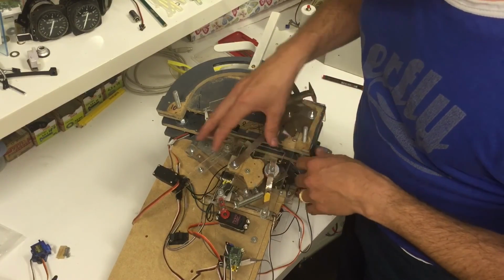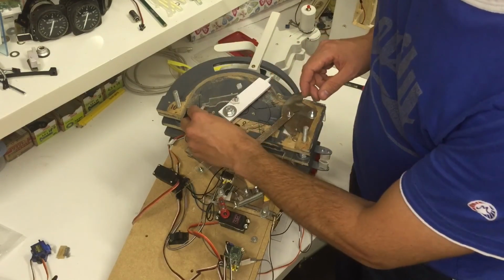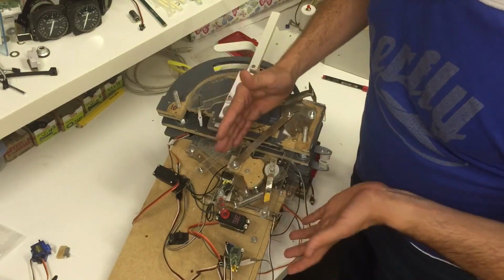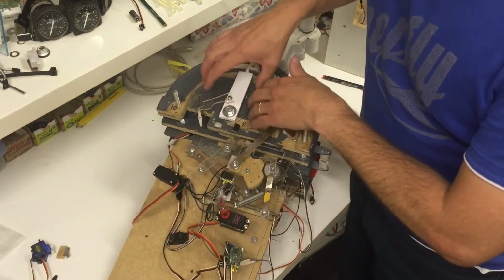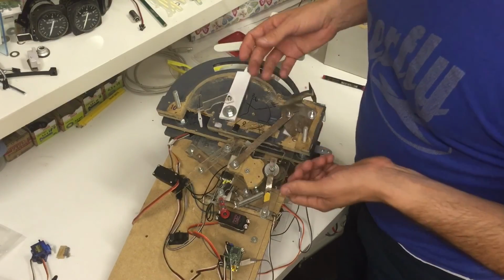In my last video, this mechanism was placed up here, but I had to make room for the trim indicator, which you can see here. So that's my advice to you: whenever you make something, if you can, make it go downward into the throttle bay, because this room up here is going to be crammed enough and you're probably going to need it for something else.